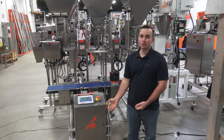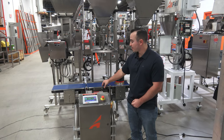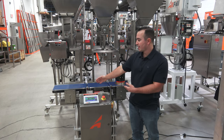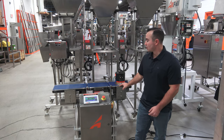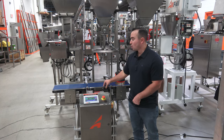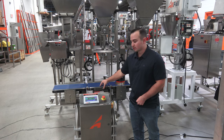The EW8 comes standard with either an 8x18 in-feed conveyor or an 8x18 weight table. They're interchangeable. This particular model has an 8x18 in-feed conveyor, an 8x12 weight table, and an 8x12 outfeed. For products ranging 8 to 9 inches long, we'll use an 8x12 weight table, and anything over that, we'll swap them and make an 8x18 weight table.